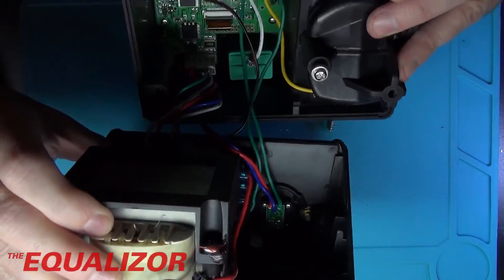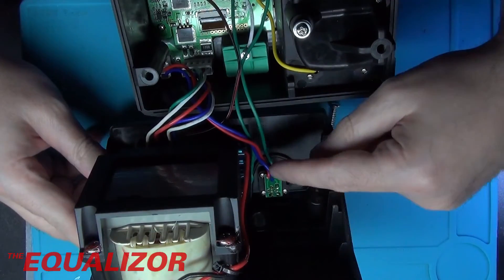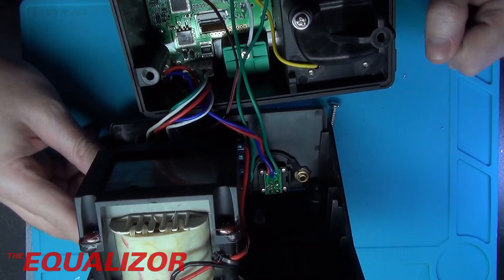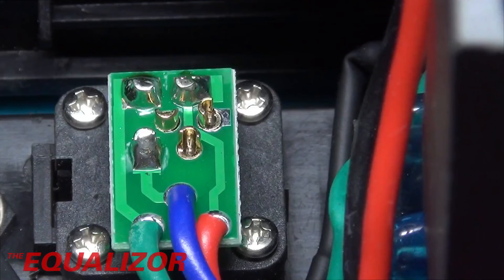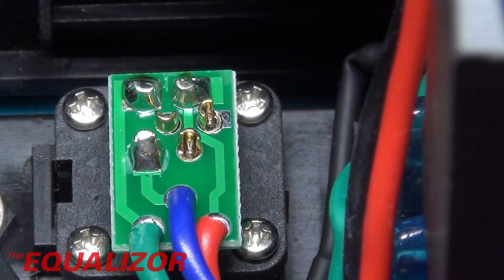This is what's inside my station. If we just have a look at this connector here, we can see that only three pins are actually connected, which will be pins 1, 2, and 5, I would imagine. Looking at it close up, we can see that only three of the pins are actually soldered in on this board — the centre one isn't, and those two pins to the right of it aren't. So this board and this iron have no way of signalling to the microprocessor that it needs to be supplying 12 volts instead of 24.